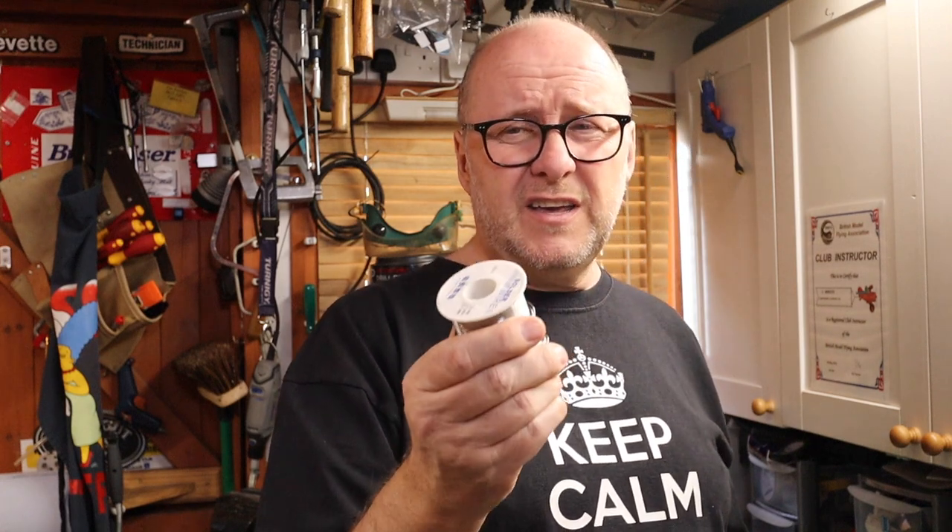This makes a big difference. Temperatures are critical and good flux is essential. Find a solder that works for you and practice: iron on, solder, iron off. You shouldn't be on there any longer than that for a solder joint. If you're taking any longer you're going to start causing damage. Iron on, dab of solder, iron off — no longer than that and you won't go far wrong.